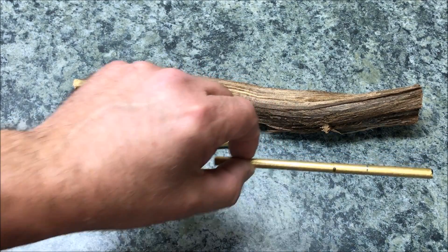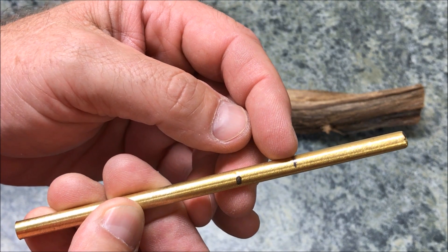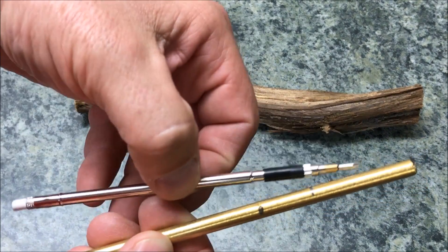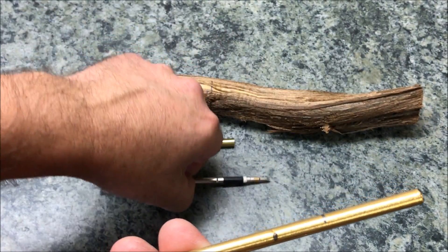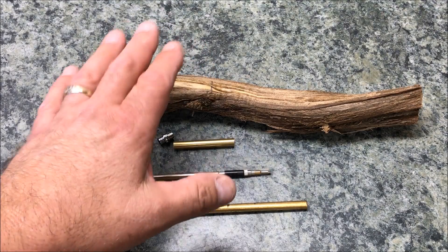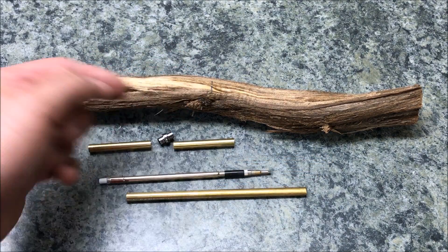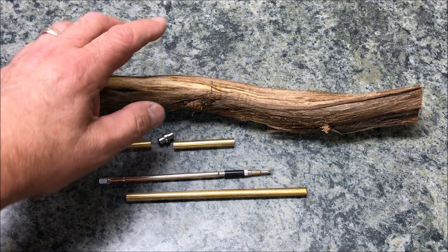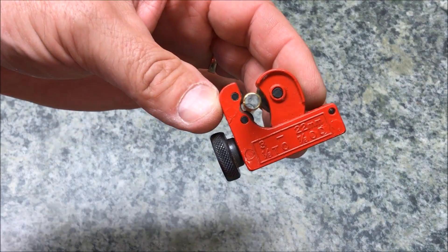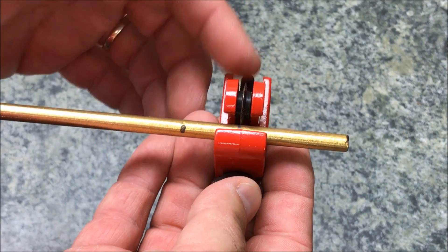What I've done is I've grabbed a piece of tube — I buy 10-inch lengths of tube and I've measured it off to four and one-eighth inches. We'll cut this little piece off and we will have a tube exactly the length we need for this mechanism. I went ahead and measured my sagebrush off to four and a half inches to give me a little bit of play. To cut my brass tube, I like to use these little plumbing tube cutters. You can pick these up at any of the big box stores and they're not all that expensive — I think around five, six bucks.